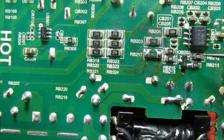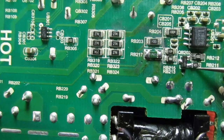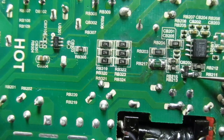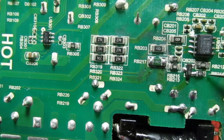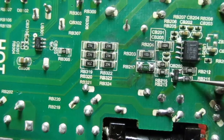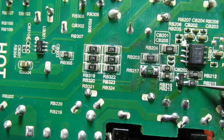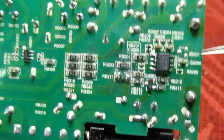RB211 — that should have been an 0402 size, but when it came I'd ordered the wrong one: I'd ordered 0805, which is about double the size. So what I've had to do is stretch it over to that transistor there with a bit of solder, but you can see it fits absolutely perfectly. Incidentally, that little PNP transistor is connected to these two resistors that were blown, but I've had it out and tested it and it's absolutely perfect.